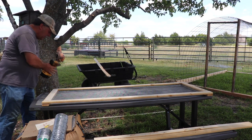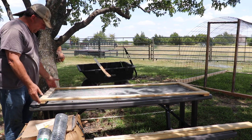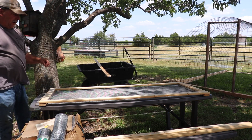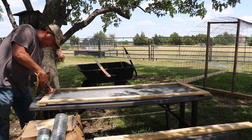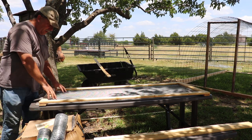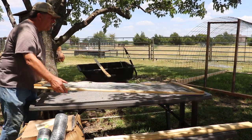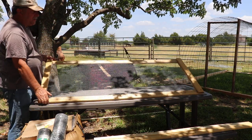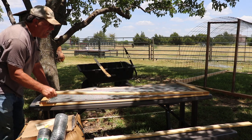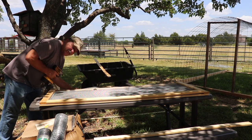That helps not to split the wood, and again these inch-and-a-quarter screws don't go all the way through. I'll end up with three or four on each end. When I sandwich the hardware cloth in there, I'll have probably four down each side. I did use my square to square it up — the metal is pretty square to begin with, so by using the metal I was able to make sure it was square. You get a nice straight line on this side, which helps square up your door. These side pieces act like cleats to make sure the hardware cloth is not able to move and holds it in there securely and tightly.